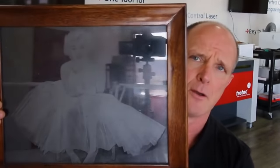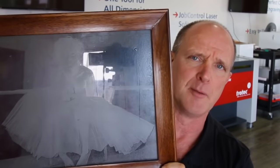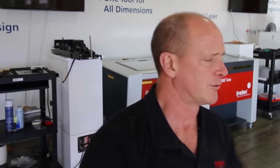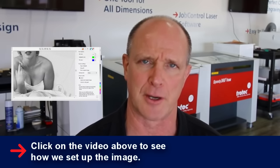This is the photo we're going to work with today. It's a nice portrait with minimal background, and it's going to be fairly easy for me to reproduce in CorelDRAW. This was a photo given to me by a dealer in New York State who was having some issues with doing photos — and again the problem was they weren't using the mask. You can't use plain glass, or you can if you want, but using a mask gives us finer detail and a more smooth etch. We don't have as much fracturing on the glass, so we get a lot more detail that we see with the actual photograph than you'd get when you bare engrave into glass without a mask.